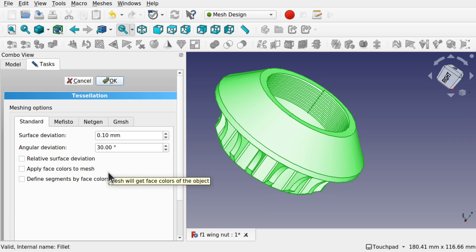When exporting from any CAD package you'll see options such as chord length, polygon count, deviation, and angular deviation tolerance. The lower the deviation, the finer the tessellation, and for angular deviation the output is more accurate to the original form bringing out the finer details. Making a more accurate mesh adds more quality but also increases the file size, so you've got a balance between file size, memory consumption, and resolution. High resolution means bigger file size and bigger memory usage.